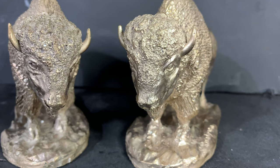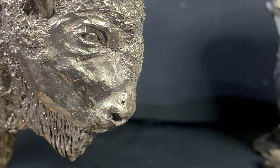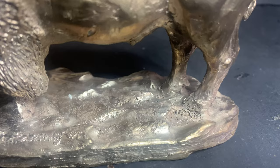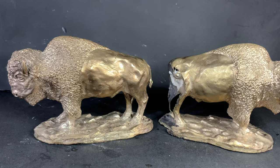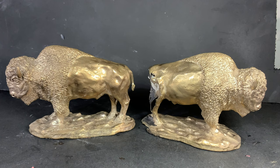So maybe just a little sharper detail for the investment. However, there are a few more inclusions in the investment model — a few pin-sized holes on the face and a few flaws on the base. Overall, there are a lot of variables when it comes to casting, and some of the differences may have just been because of how I sprued it or the temperature of the metal. Either way, professionals use both methods for getting very high quality castings. Let me know your favorite method of casting, what you thought of this video, and come on back for the next one. Thanks for watching.